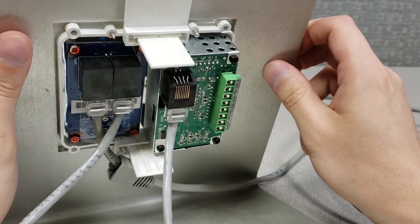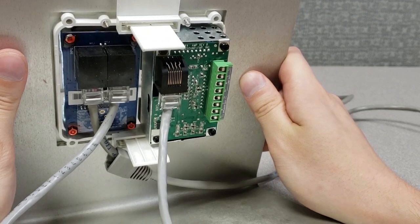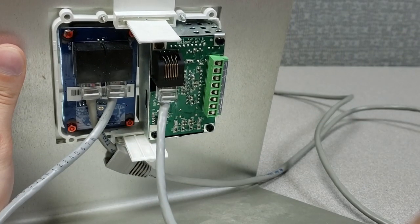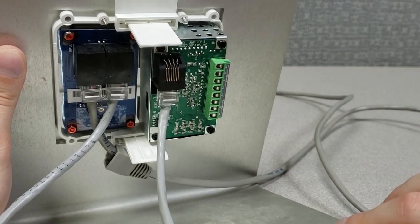So now we have a setup going from our A-Bus hub out from one of our keypad ports. The Cat5 wire run comes up, stopping at the BTA2, going in and out via a second Cat5 wire, finally ending in our AK-4 keypad, where we'll have speakers hooked up.